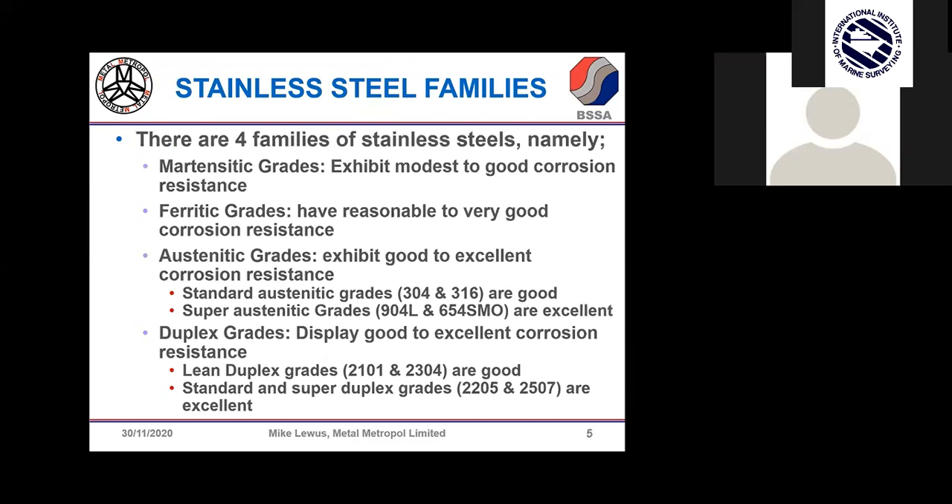There are several families of stainless steels to choose from. The four families are martensitic, ferritic, austenitic, and duplex grades. In all these slides there are brief pointers as to which are good or bad with respect to corrosion resistance. The ones most familiar are the austenitic grades — they exhibit excellent corrosion resistance as long as the protective surface layer isn't destabilized. We're talking about a marine environment, and we know there are species there that will particularly disturb that layer.